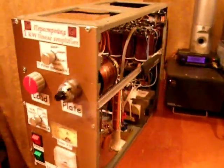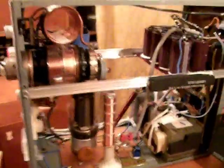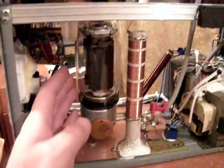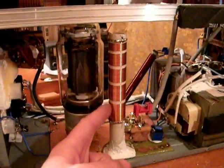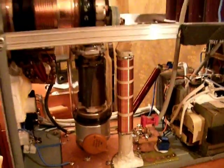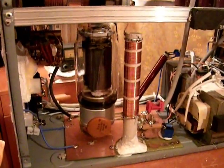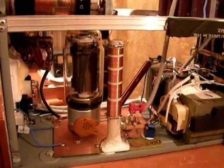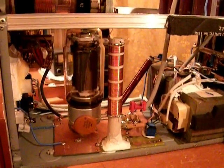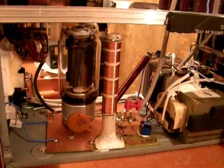So here it is, here we have it with an inside look. In the bottom part of the amplifier we have the tube, the GK-71, and the anode choke which is built according to recommendations of LZ2ZK on his site. It's true that this choke was built for an amplifier with GU-50 tubes, but it's working just perfect with this combination with the GK-71.